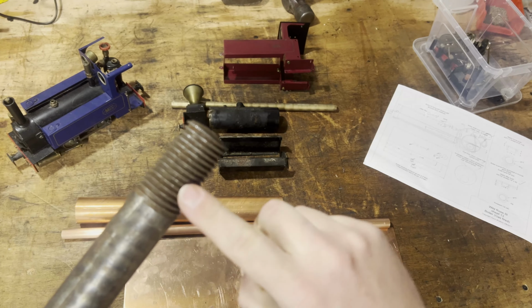Here's our bit of copper. So we'll put that on there with this randomly sized but good lump of steel. And clamp it to it, make sure it's kind of evenly spaced. And then just get to work, holding on to the clamp to stop the whole thing moving in the vise, because it's only on two little pinch points. Take it off, rotate it, clamp it.